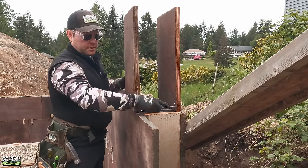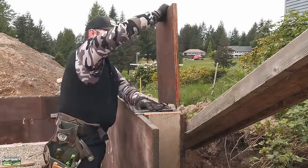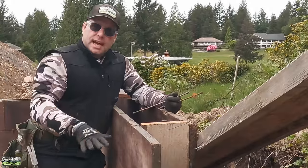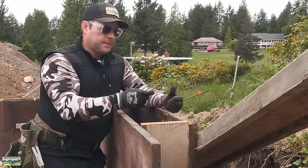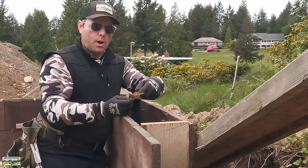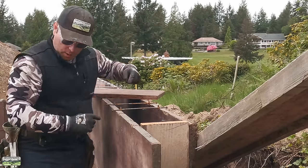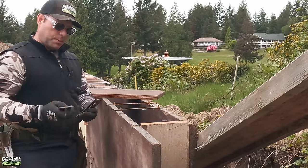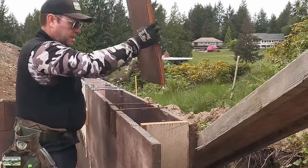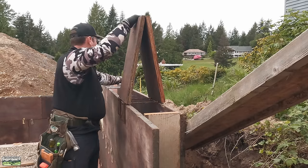As we start to stack panels — like you see here — on this one we went up to 10 feet. It's easy, stacking two feet at a time. This is a snap tie; it fits on top of the wall. It has a washer — I'll show you how that works. The washers fit inside the wall. These are called shoes or wedges. Hang them, go ahead and set your panel. I'm going to cleat the top just so it doesn't fall on my head.